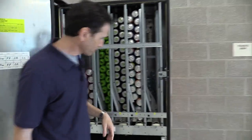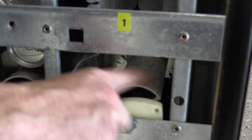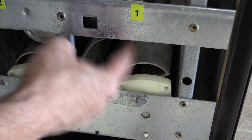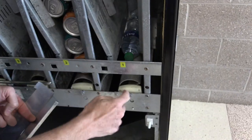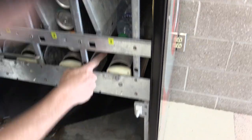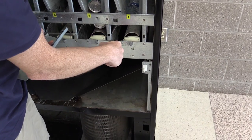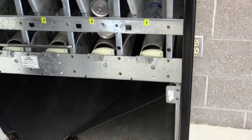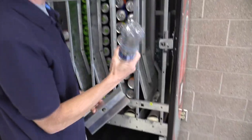Why is that happening? If you look at the rotor, there's a pretty big gap there. This isn't the opening of the rotor — there's an opening where the bottles and cans fall in and then it spins around and they come down. But when the rotor is in the position where there's no dip, there's enough of a gap that when it's spinning and dropping another bottle, it will pull the squishy bottle into that gap. When bottles get colder they get even more squishy. Then there'll be a bottle smashed halfway in, and when it spins to get the next one, it's dropping a smashed bottle — sometimes two at once — and it's just a big mess.